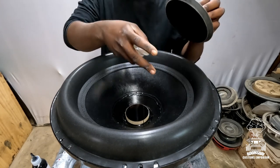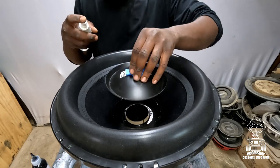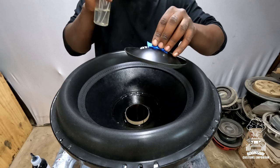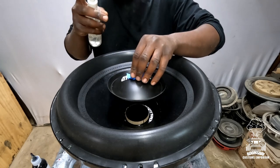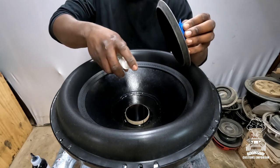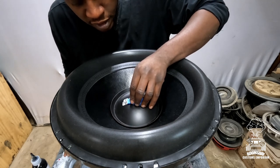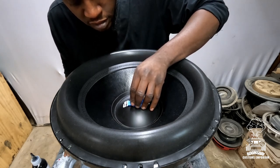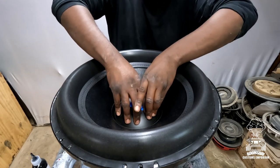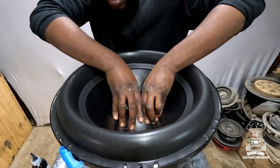All right, once you got the bead of glue down, dust cap in hand, activator in hand, you're gonna wanna make sure you got it lined up, make sure you got a good handle on it. I do a light spritzing of activator, place it down, put a little weight on, and then the SA8's gonna go on top of it, okay? So, light spritzing, watch my line. There's my line. Nice and flush. A little pressure. You can take off your masking tape now. You don't need it anymore.